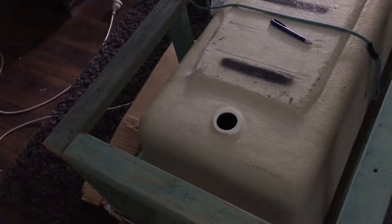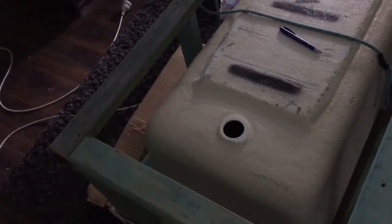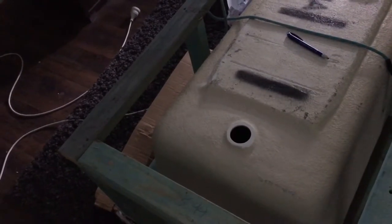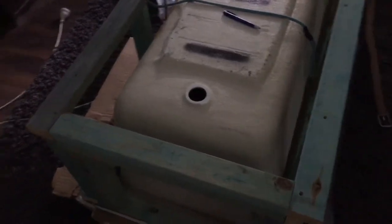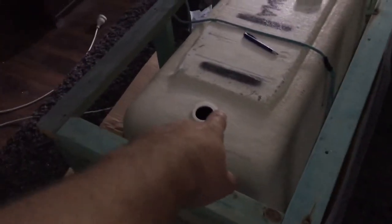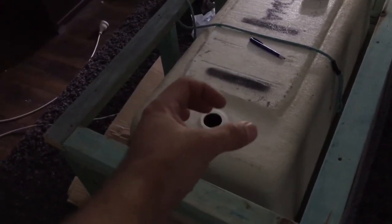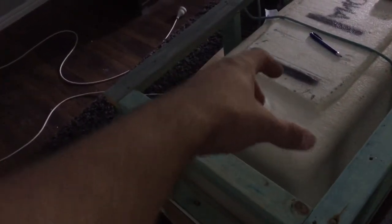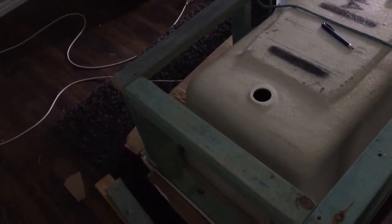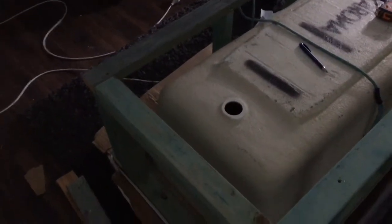I just have to put the plug hole fitting in, and I'll probably screw it together and cut out a rectangle, because when I'm putting it in I'm going under a mixer tap that's already in the wall. I've got to raise that up probably about two inches, which means putting it in is going to be a bit of fun. If I just do a hole saw, I might not be able to get the bath in with the fitting, so I'm going to cut a square out and probably won't even need to fill it.